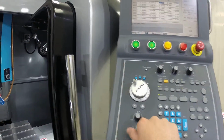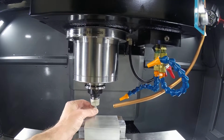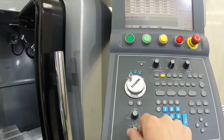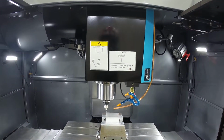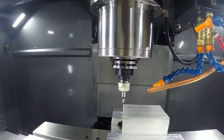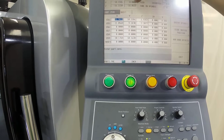And normally what I do at this point is I stop the spindle. I then also center up my indicator just by hand. I then move my X-axis. I switch to thousandths. And I move this so I get over to the rough center line. So what I do is I double check myself. I move it over to where it's roughly centered, and then I come up here and I look and see where we're at, and that was pure luck. But if you look at the X, we're actually at 0.